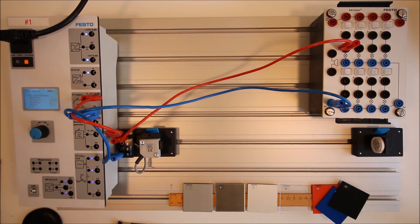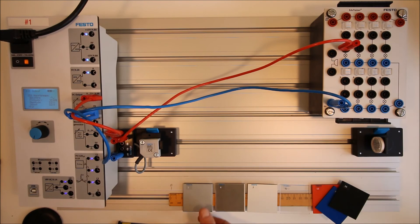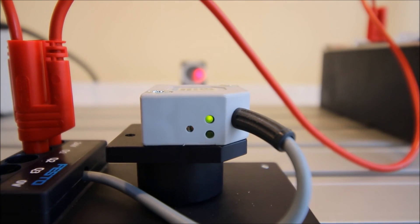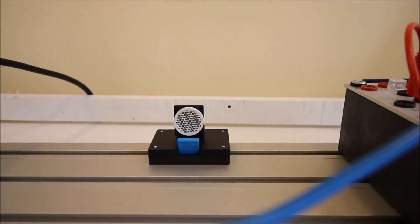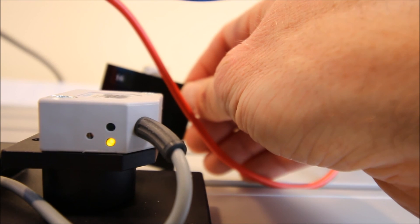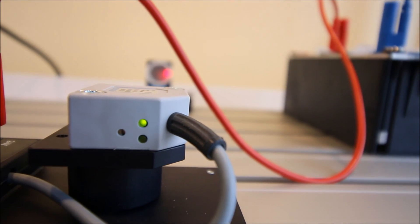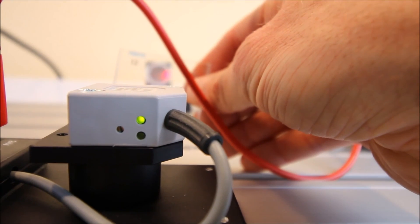The only thing it did not see was the clear piece of plastic. This suggests our retroreflective sensor is not a polarized retroreflective sensor — a polarized version might be able to detect the transparent plastic as well. Hopefully that gives you a basic understanding of the retroreflective sensor: it can sense quite a large distance — 10 feet would probably still work. Any dense material will obviously block the light and give an output. The LEDs on the back provide diagnostics: green means it's sensing the reflector, and yellow means power is applied but the reflector is not being seen.